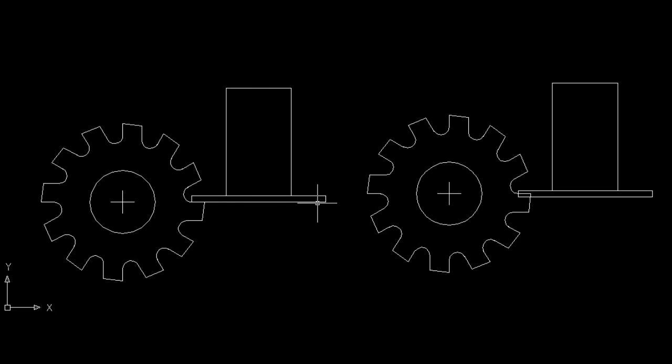and lock it there. If you look over here, you see I've dropped the cutting edge down into the cutter to sharpen the edge. That's not what we want to do. This is a rotational cutter. So I'm going to rotate on the rotary table up into the cutter. The cutter will be right on the center line until I hear it engage. And I'll just engage it just enough, doing it all by how well I hear. And then I will back out, look at it, see that it's polished, and if that's correct, then I rotate it to the next station and then bring it back in again, and I'll sharpen the next edge.